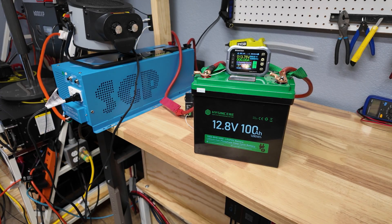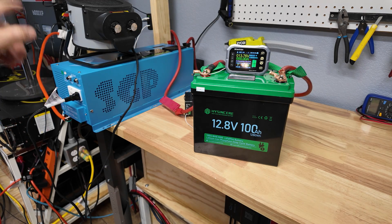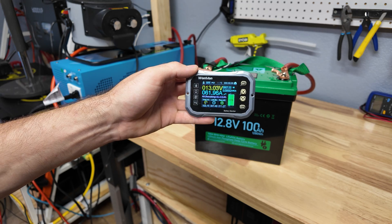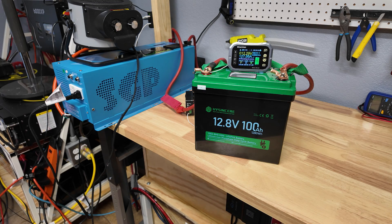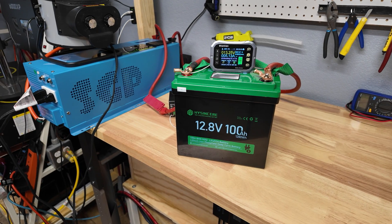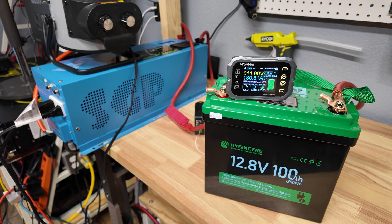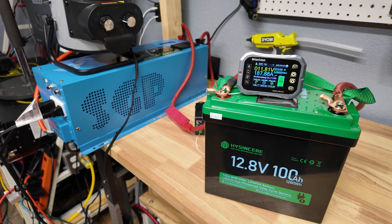The battery is fully charged again for the HiSink. Now we're doing the full current discharge test to see how many amps we can pull. We have a 1,500-watt space heater which will draw over 100 amps. We'll let it run and then push it even harder to see if and when it shuts off. Kicking the space heater on high — about 127 amps. I couldn't find my heat gun so instead we'll use a 30-amp battery charger as a base load — that's almost 50 amps by itself. Adding the space heater on high gives us 180 amps — that's over 2,000 watts. We're letting it run to see if it shuts off.